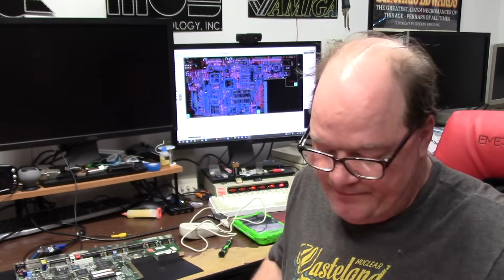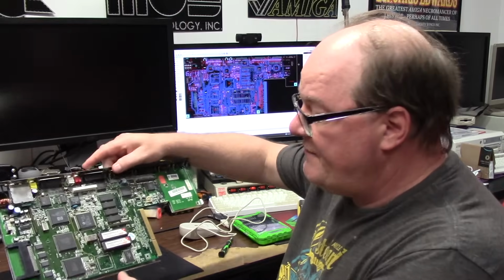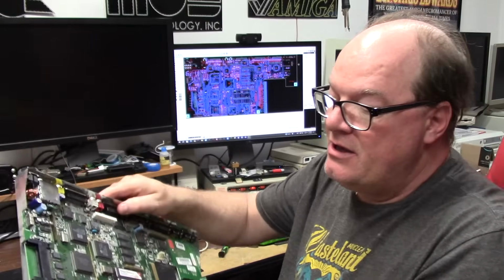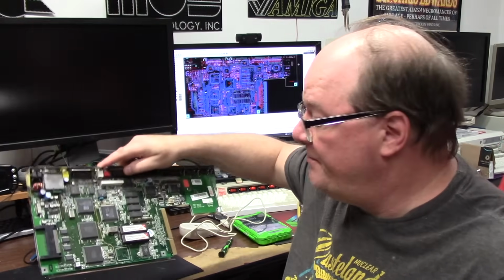No note, but Mr. Michael is probably about 50 miles from me. We have an Amiga 1200. This is a 1B, exactly like mine. You got the 3-wire factory fixes for the budgie timers and stuff, and the video DAC. So this was just in for a recap, and it looks very clean.